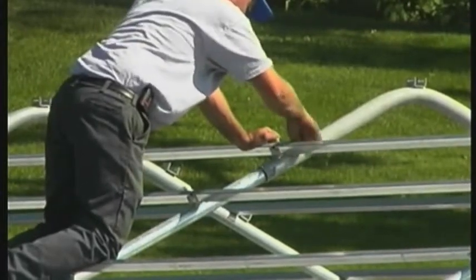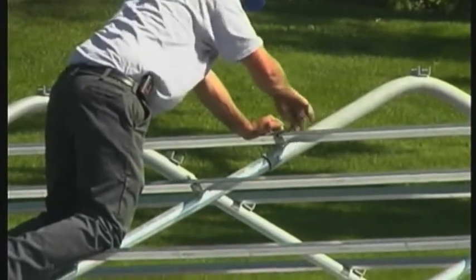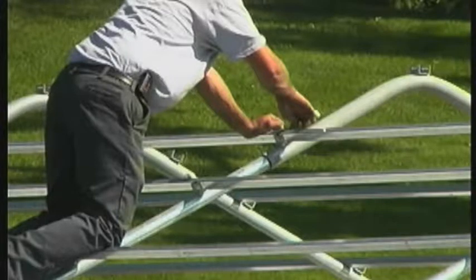Install the slats all the way up and the 2 slats over the top of the crown, tightening the set screws in the middle of the canopy bow first. On the second bow out from the slip turn, you will only tighten the set screws on the first 3 slats up to the first bend of the bow.